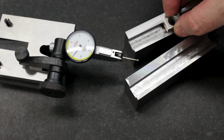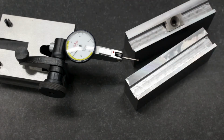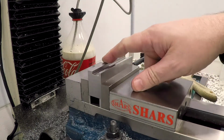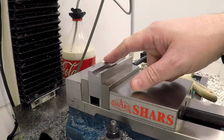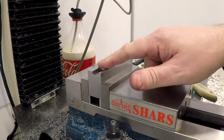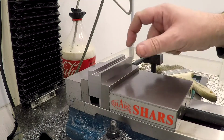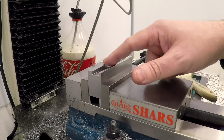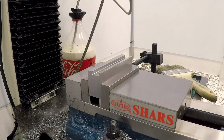And we'll do that with a carbide end mill and then drill and tap holes to hold them. Okay, I have one of the jaws set back up in the vise. Again, zeroed on the center of the top back edge. And I have a 1/4 inch 4-flute carbide end mill, and now we're just going to finish the slot out to width. I didn't leave any allowance, so it should come out exactly to 501. It probably won't.